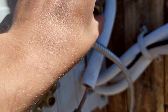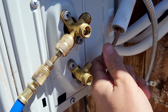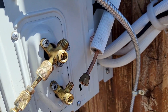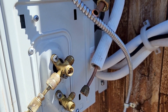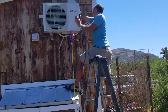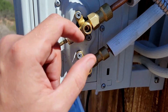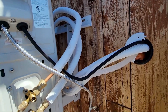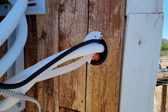The game plan now is to cut off the initial flares and replace them with the push-to-connect fittings, because there's definitely a leak somewhere in here and I'm putting it down to user error on the flares. Those were pretty simple to install, though these were the tough ones because you still have to get the nut tension right. I'm glad I didn't cut these lines short because I needed more line on the inside — the only issue is there's spray foam in there, so that's going to be fun to push through.